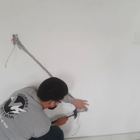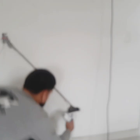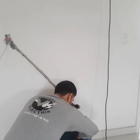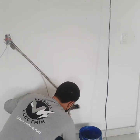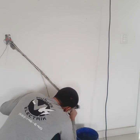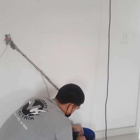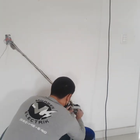Here I'm sticking the wire into the wall and then putting the new box in. I'm spraying it so the concrete catches better. For the box I'm using concrete to get it in there good so it doesn't go anywhere. It might be a little overkill, but it's always better to take the extra step so you don't get a callback that the box is loose.